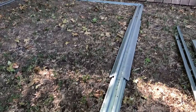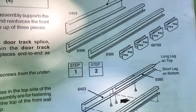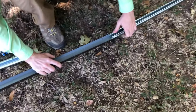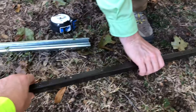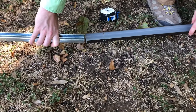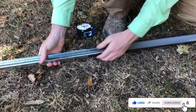Definitely check the square before you start adding pieces to the main frame. What we're doing right now for step four is getting the 9366s — two of those — as well as the 6403, which is the door track splice joining the two door track pieces end to end as shown. Make sure the holes line up. On the door track splice, brown wood paint side up — you want the one with all the holes at the top. Go ahead and slide it in midway, because the other end is going to come in there. It should slide in fairly easily.